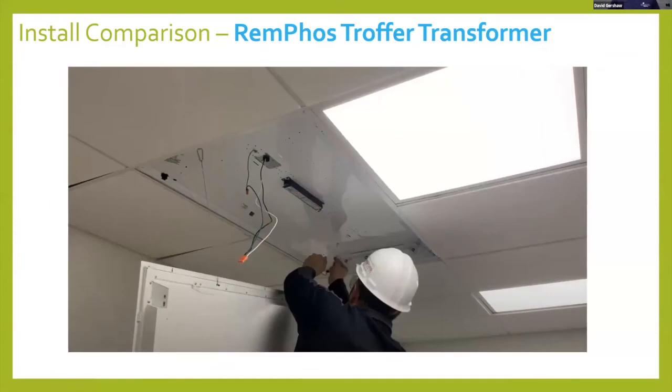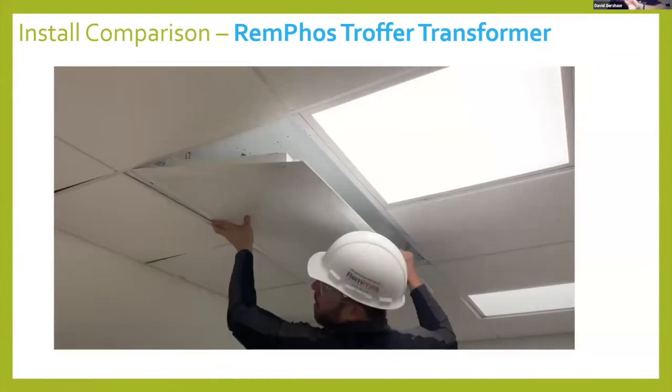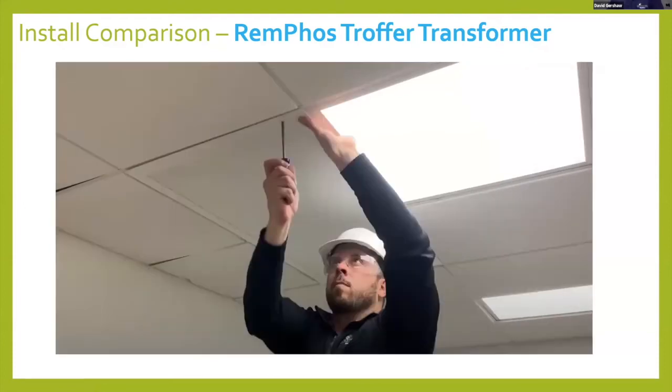So that's step 2. Step 1 was hanging it in place. Step 2 was sliding one end of it up into that fixture. Step 3 is to take a Torx screwdriver and twist either the 2 on the 2x2 or the 3 Torx expanding fingers. What's happening when I twist this mechanism is it's going to take these expanding fingers, and I'll show them in a minute so you can actually see what they're doing, and press them out. And it's the fixed knife edge on this side, and then the expanding fingers on this side that lock it up in place.